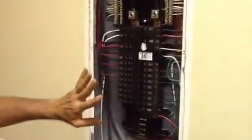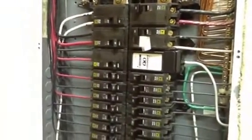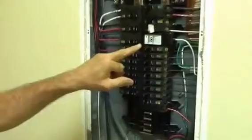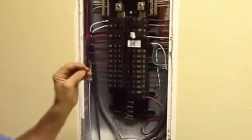Now, when you know it's working correctly, you're going to have a green LED light. I want you to look at that really close right there. If the LED light goes off and your power is on, that means the surge protective device has taken a hit.